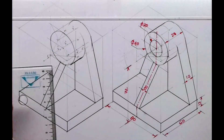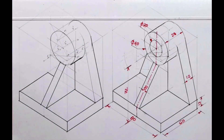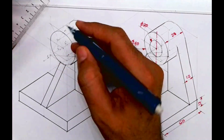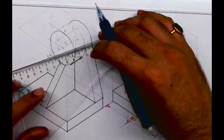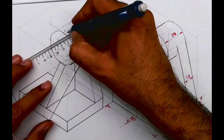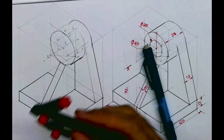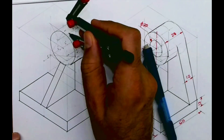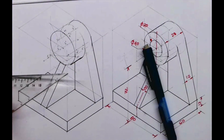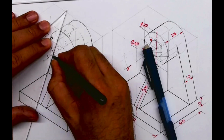Now from this line again we need to draw an arc — a tangent. For that we need the radius of this part. I will take point 3 behind by 16 — that is 3-double-dash. From that point we'll draw an arc, taking this radius from 3-double-dash. Now join this way — this is how you'll get that part.